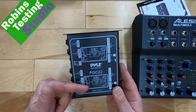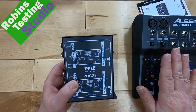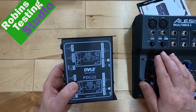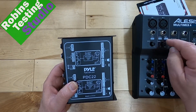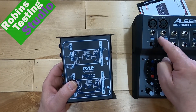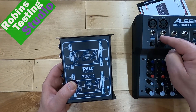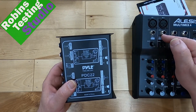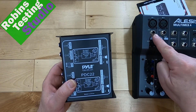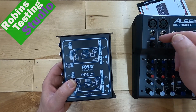When we take a closer look at the unit, it's important to have a reference next to us. In this case, we have a four-channel mixer, and this mixer happens to have what we call a high Z button — they title it as 'guitar.' This is going to do what a DI box does internally, turning the first channel into the same thing, allowing us to plug a guitar in. If we look at the quarter-inch on an actual mixer, this would be considered a low Z.